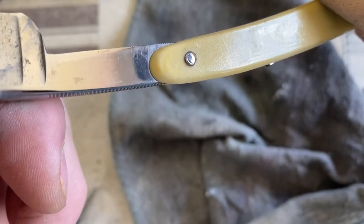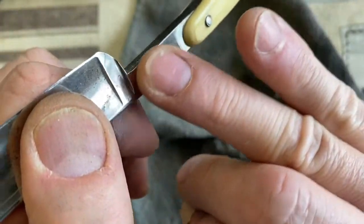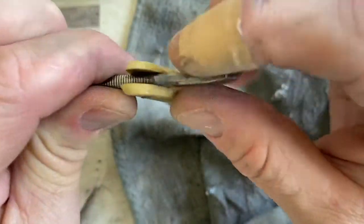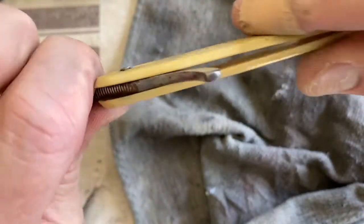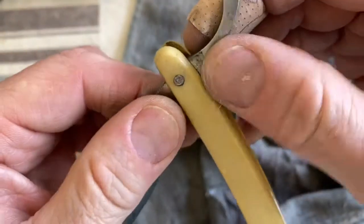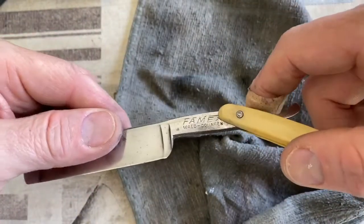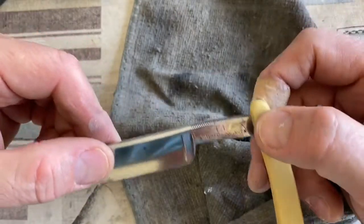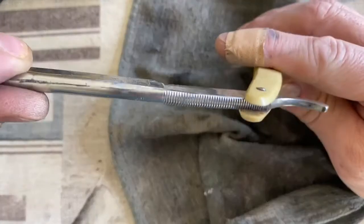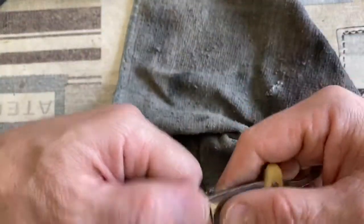The mark is still there because it's a deep crater, but it's not black anymore — it's nice and polished. That's what we'll do with the entire blade. The tricky area — and that's going to be a next video — is getting in here, because there's two ways: very fine manual task getting in there with brushes and sandpaper, or you unpin the pivot, take the blade out as a loose blade to polish, then put it back and repin it. There's always a downside that things won't work out, so I try not to unpin a razor if I don't need to.